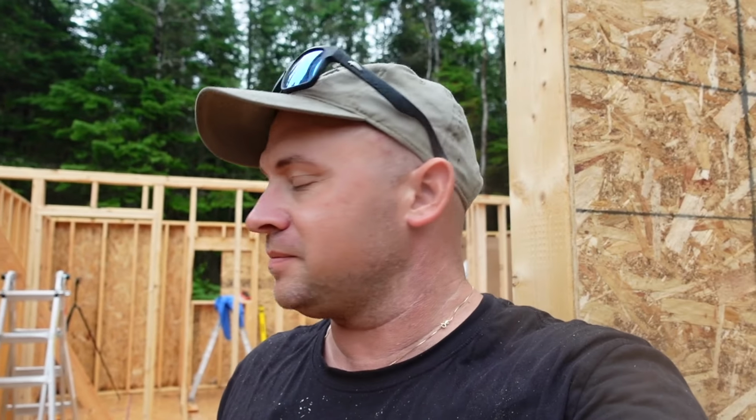So it's off and on raining, and I think the rain is kind of picking up again, so I'm going to call that good for now. All the interior walls are done. I have all of the top plate on the interior walls. I just need to go around and put them on the exterior walls, the top plate, and then we're ready to throw those trusses up. So that's pretty cool. We'll start putting the roof on it. So thanks for being here, and see you in the next one.